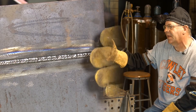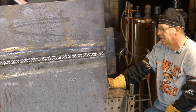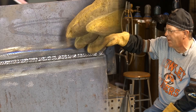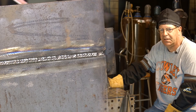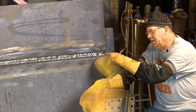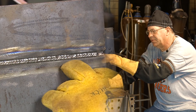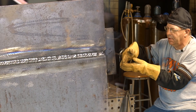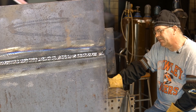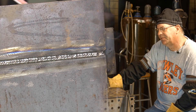What I would not do at this point is go straight to cap, simply because we've still got a fair amount to fill up at the top. I've seen a lot of people do this — they'll start running a cap, run the first bead a little too low, run the second bead, and then they've got this big valley at the top to fill in. And that's not getting in there properly. I've seen a lot of them fail a bend test too.